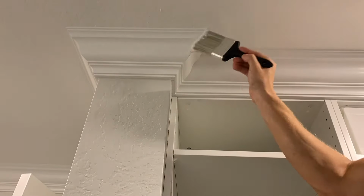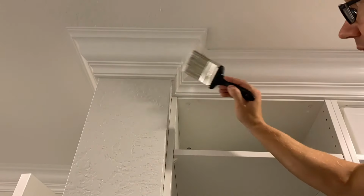As you saw, my trims were a bit short and my miter cuts were not perfect. But really, if you take your time with this stuff and spread it carefully twice or three times, you can make it look really nice. There is a better way to do those miter cuts. The technique is called coping. If you're interested, you can go online and search it on YouTube. The coping, I think, is the only way you can make those inside corners 100% perfect.